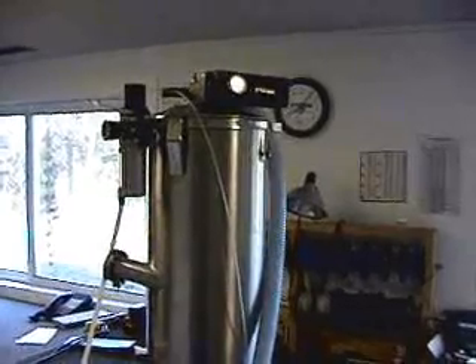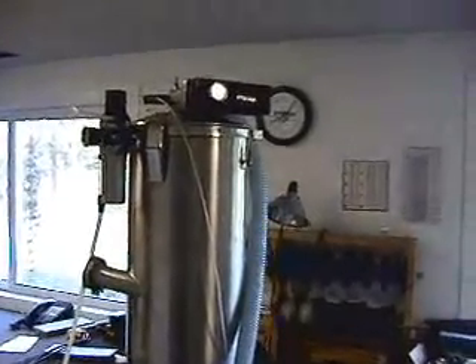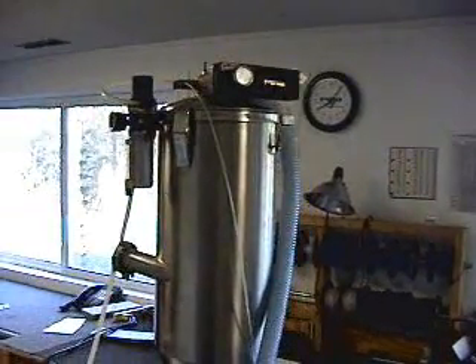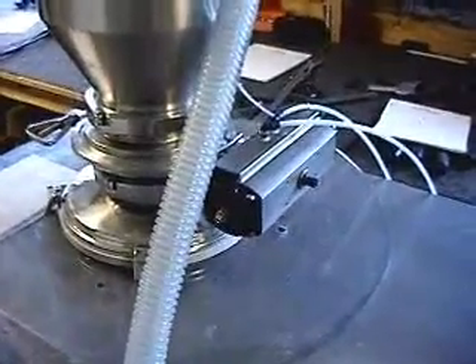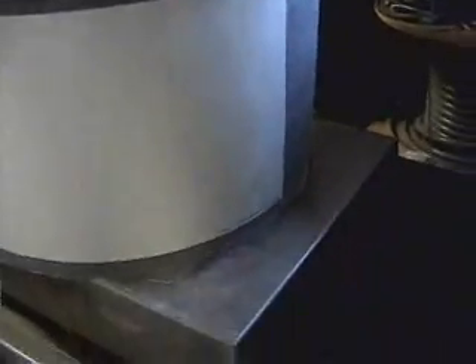This is a homemade video showing our batching capabilities using vacuum transfer and a reciprocating rotary valve. We have here the vacuum conveyor which is sitting atop the rotary valve, which reciprocates at 180 degrees, allowing for accurate batching. It sits atop a collection container attached by a flexible connection, with the container sitting on a Mettler Toledo scale.